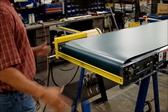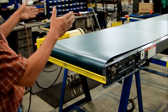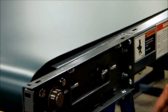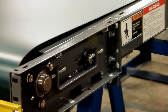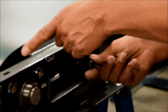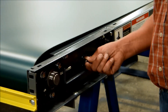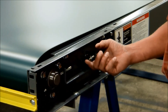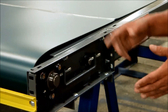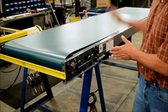We'll take a look at the drive pulley at this time. You'll want to come up here and make sure the belt is tracking right on the edges of the drive pulley also. There are times when you get it to track on the infeed pulley but it'll be off slightly on the drive pulley. That's where we'd use the snub roller — we'd go ahead and move that one way or another to get the belt to move on the drive pulley. If I move it all the way forward just to demonstrate, you'll actually see that belt start to move over. You can see right there it's moving my way. If I let it back, it'll go back over. So if the belt had been off, I can move it on the drive pulley a little bit one way or the other with the snub roller, and it won't impact the infeed pulley — it's too far away from this roller to impact the infeed pulley.